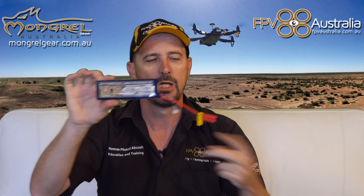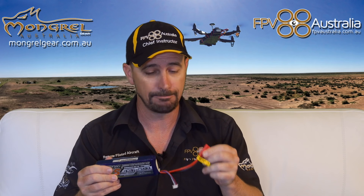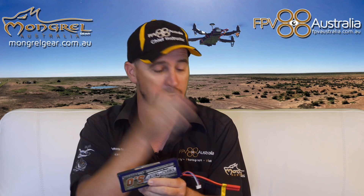Let's go back to the conventional LiPo. If we plug this into a LiPo charger — and it must be a specific LiPo charger, not a conventional 12-volt plug pack — and we put it on charge and decide to go to the shop, for whatever reason the charger's circuitry fails to recognize the battery's full. It continues to feed power into the battery, and at some point the battery says it's had enough, and the result is a lithium polymer fire.